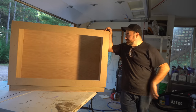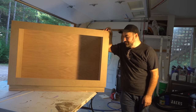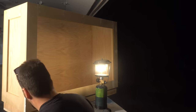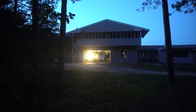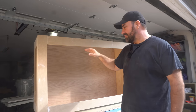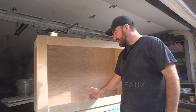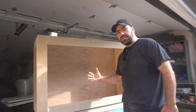This thing is looking really nice. Keep in mind there are still these little marks — they're all going to get filled in with paintable wood filler so you're never going to see them. Alright, I've filled in all my holes with wood filler, did a light sanding. I'm going to touch this up one more time before we paint it, but I don't want to get too far because I still have to build the panel that goes right here.